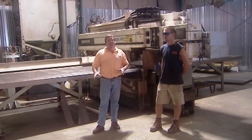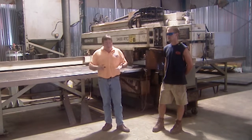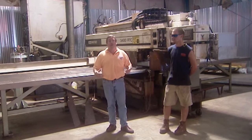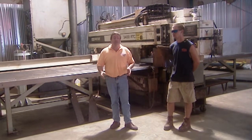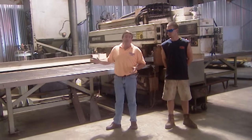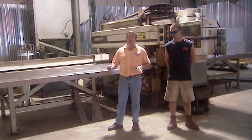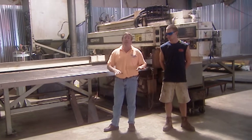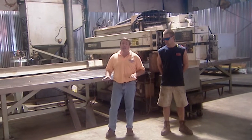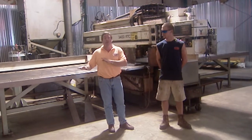We love that. And then if you're going to run a Whitney, the three companies I've mentioned have all moved to a program that I started out with first, which is SigmaNest. SigmaNest has been writing the post that runs a Whitney since the Whitney has been built. A lot of companies have a post that kind of runs it, but if they ever switch to the SigmaNest post, then they just trash the system they've got and buy SigmaNest. It is a really great system to operate this. I hope that's what you plan on using if you buy this.